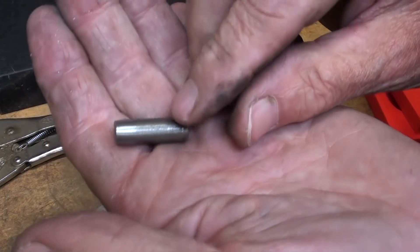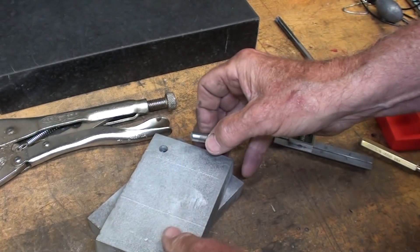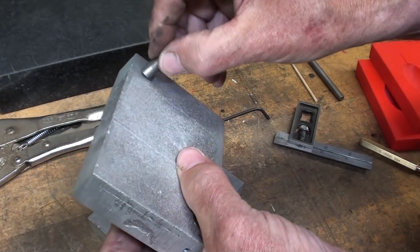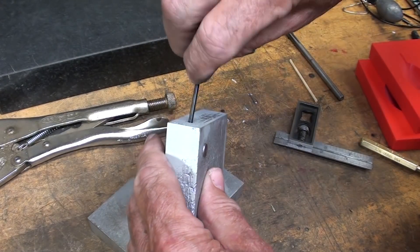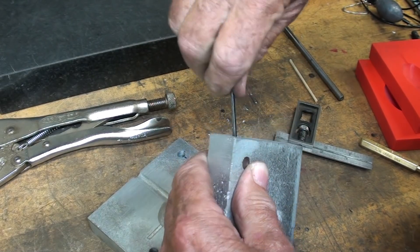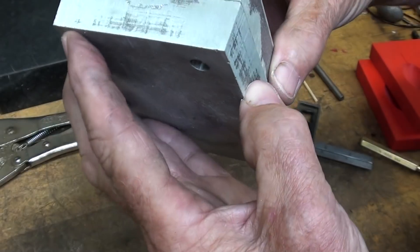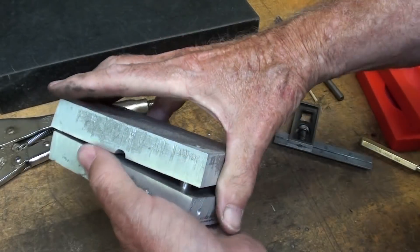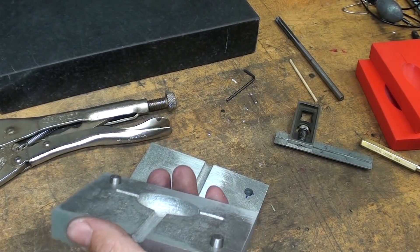Alright, I made two of these pins — that's five-sixteenths. There's just a little bit of a taper and a chamfer on there because I don't want them to bind. I did indeed drill and tap two 10-24 screw holes. I'll just snug those up, because I'm sure they'll come out ten times. Do they go together? Yeah, they do. I don't want them binding when I've got gloves on — they're just 600 degrees — it's just a real pain in the neck.